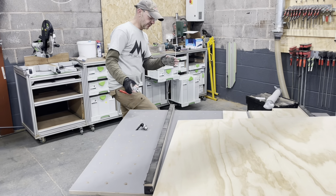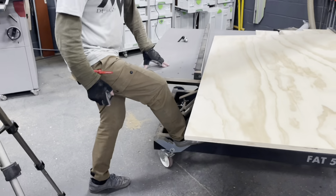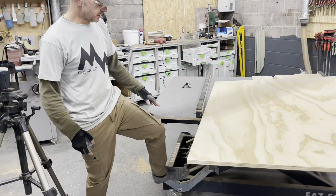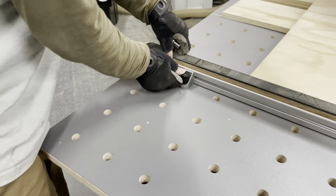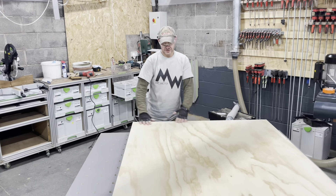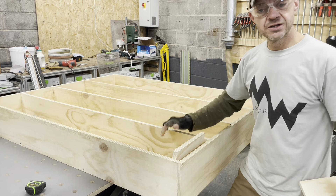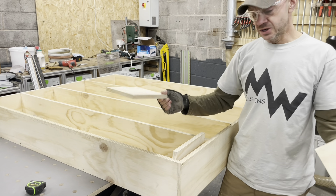I also use a lift table — both Rui and Felder make this table. This is actually the bigger 500 model, which I might do a little video on. We had a problem with the smaller one with massive tables because the pump is at the back and you can't get a leg under, so this one lifts a lot more weight. If you've got really big resin tables or big dining tables, it's an easier option and very sturdy — pretty difficult to tip over. No need for clamping thanks to those little foam pads, so you can pre-assemble from the top, drill through, flip it, and fit the shelves. The massive benefit of the CNC style machine is obvious here: no test cuts — just dial in 250mm spacing and keep knocking out a perfect 250 every time.